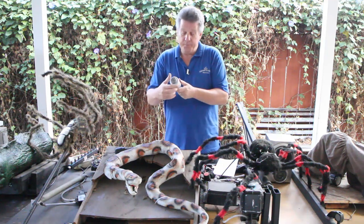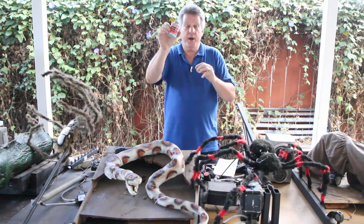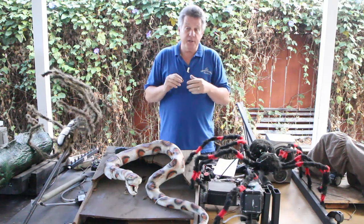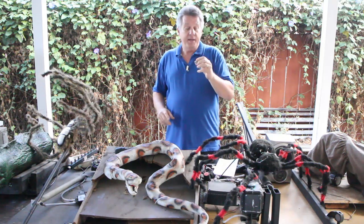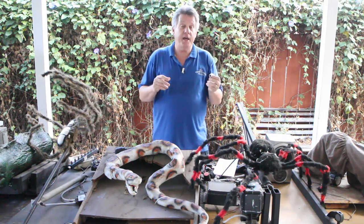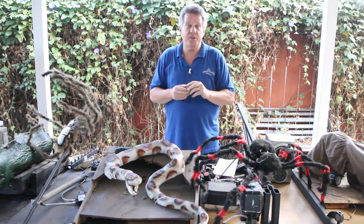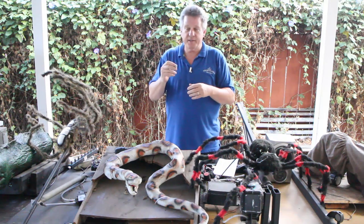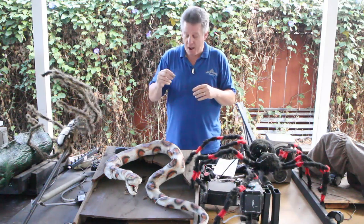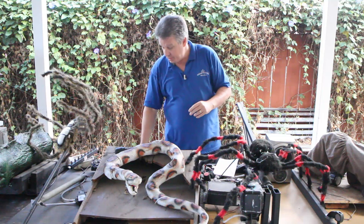A lot of these fittings come with a few wraps of tape on here. When you're doing your pneumatics, air is gold — you want to make sure that you don't have any leaks or minimize them as much as you can. I find that sometimes I still get leaks if I just rely on the thread wrap that comes on these. So I always add some T plus two — spread a little bit of this all the way around, put my fittings together, and let it set overnight if you can. It really takes care of the leaks for me, and I can be confident that my system is nice and solid and not wasting air.